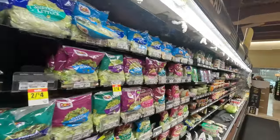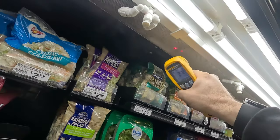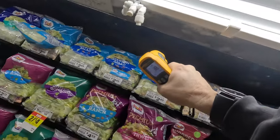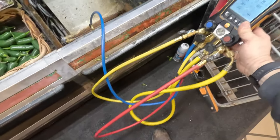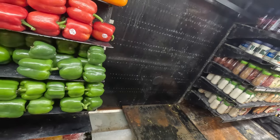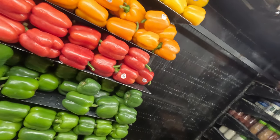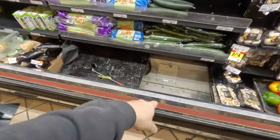There's 28 on that one — and what it does, it averages these temperatures. Superheat — well, it's back up to 21-ish area. It must have shut down is what I'm assuming. Yep, now it's back to 30. And this one here is at 40-something. Well, I went ahead and yanked out this here. I was able to check the fans, make sure they were running here. And they're running down there. And the furthest one all the way down there is also running.